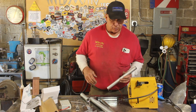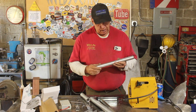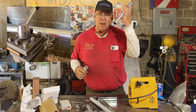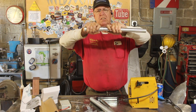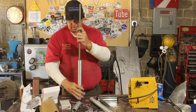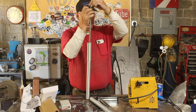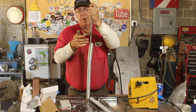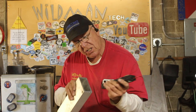Over at the scrap yard I found some stuff I could use, nothing that was quite right. I found this piece of tubing that is pretty thick wall, so that's nice, and it's made of aluminum. It was a little bit too large in diameter so I had to turn it down on the lathe, and it's also too short but it was the only piece I could find. So I also got this other piece of tubing over there and we'll just interference fit those together with a piece of threaded rod and then weld it. And I also found this piece of rectangular tubing that is just right.